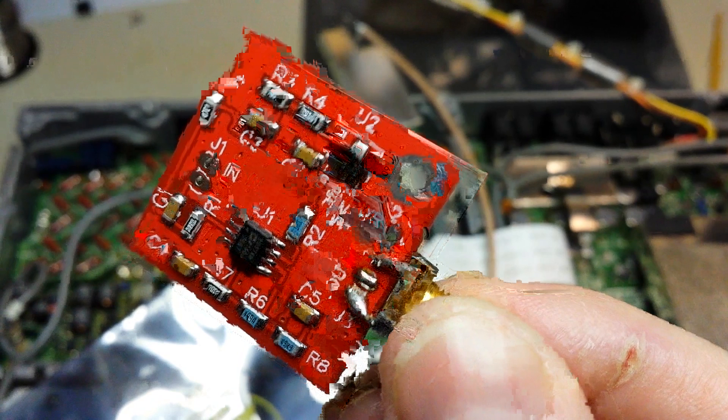We decided to drill a little hole — that's up to you — and install a small SMA connector on there, which makes it really handy for plugging in and out. Otherwise you can do it the way Matt's instructions describe, slipping the micro coax through a gap that lifts up enough to thread it through. This approach works well and means the coax is secure so you can't accidentally pull it out.